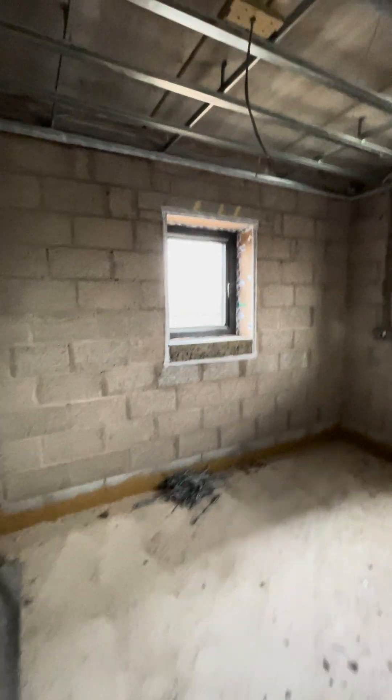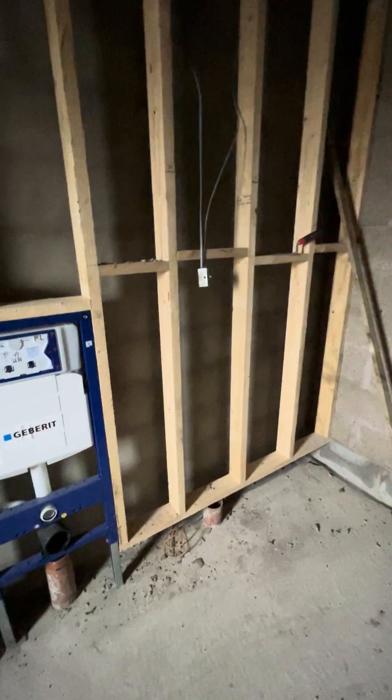Into the hall at the stairs — again taping right here, and you can see the window membrane wrapped around, the slab wrap detail all the way around here, the Varifluid continued and back into here. This is an important detail too: for a stud wall for your bathrooms, normally they would be cored into the wall or a big hole dug out, which gets very leaky. So we stud that out, which stops any drafts or leaks from the room to outside for all your bathroom fills.